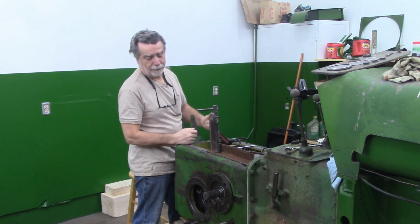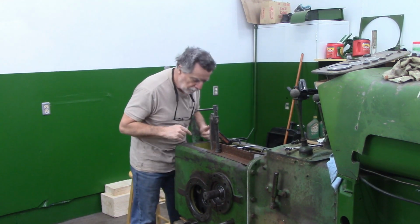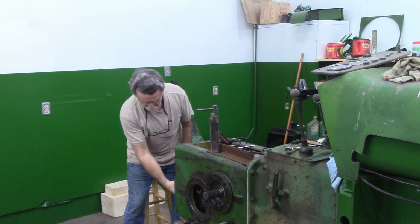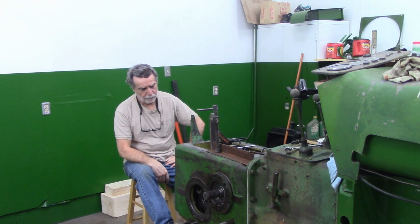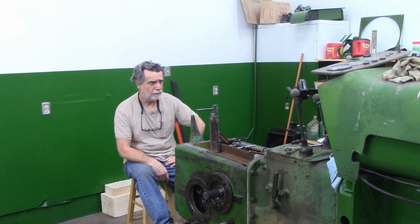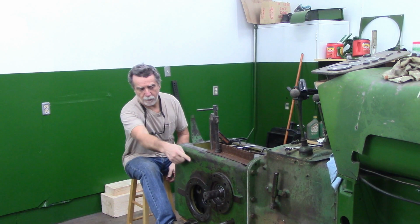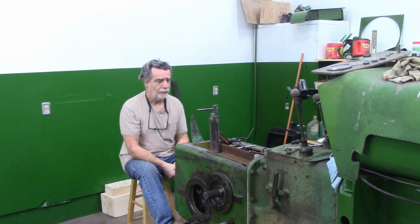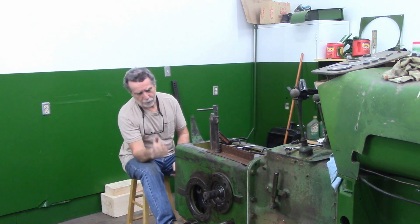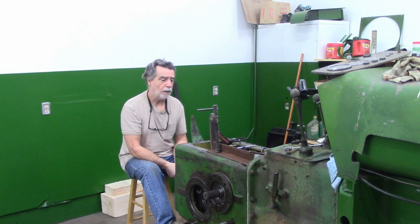Yeah, I'd like to. If I can't, I don't think I can get it out far enough with the bull gear in here. The little stub piece that is the low speed, the coarse spline PTO, I did try to remove it on that other machine, and I don't like to use violence, but I got pretty violent with it. I wasn't 100% concerned at the time about that because all I wanted was the shims. I'm not going to get violent with this one. There's no way in hell. I need this one. So, okay, I know I can get it far enough out to get the shims and hopefully fix this problem. O-ring, we'll cross that bridge when we get to.